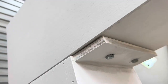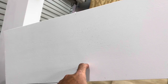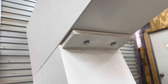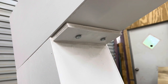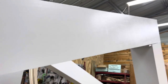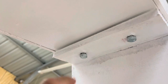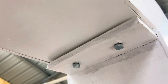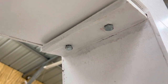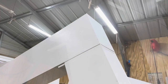This is what I mean with the holes being in it — if you turn that the wrong way, it's not going to work. This is the way I'm attaching the tops: I have two T-nuts in the top piece right here, and then these bolts just screw through the holes. The best way to line these up is to put them up there and use some clamps to hold everything straight while you're doing it. You drill the holes in these first, then when you put your top on, you line it up, put your drill bit through the hole, and mark it — that way you'll know exactly where to drill the holes in the other piece.